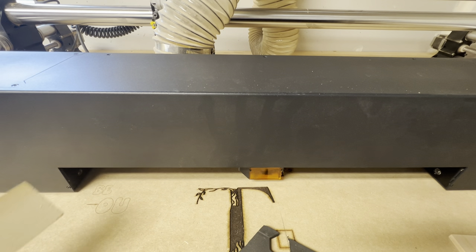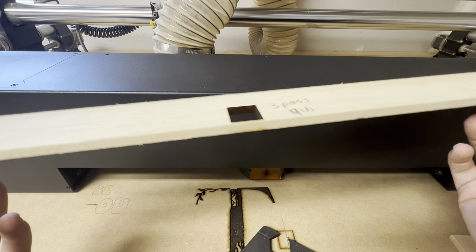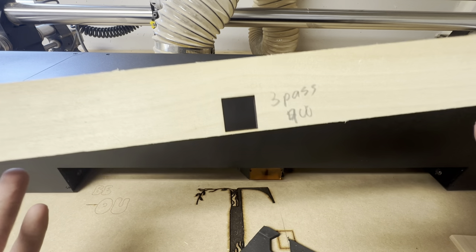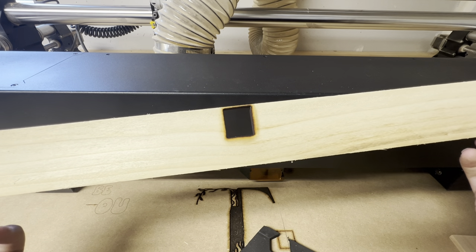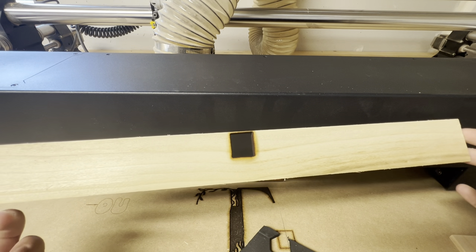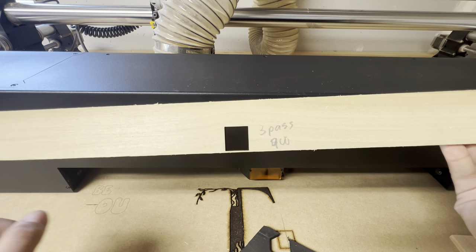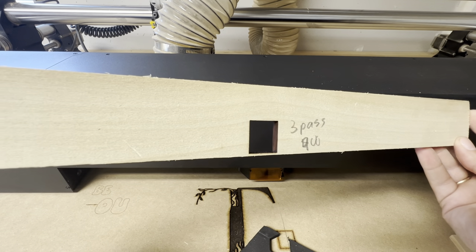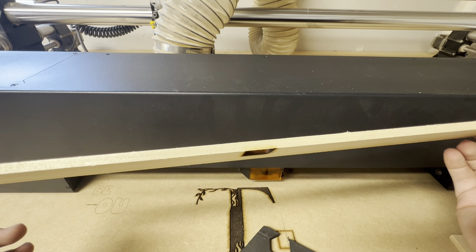Now into the harder woods. This is not necessarily hardwood — I believe this is poplar. This cut with three passes, which is really nice. You can see the burn is really only on the bottom because they were completely flat on the MDF board. If I had them raised, I'm sure that would be less. It's really nice to see that it has a clean top, so if you were cutting out letters, it would have a clean cut all the way through. This is about three-sixteenths of an inch of poplar.